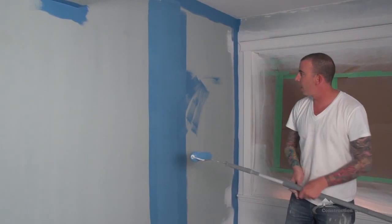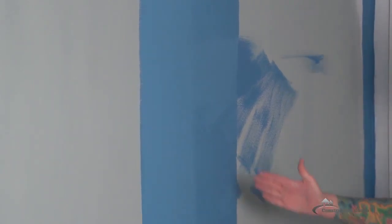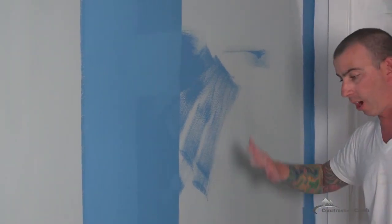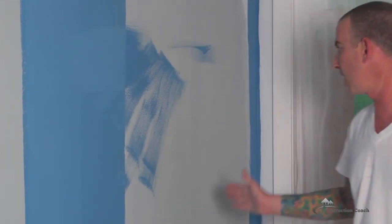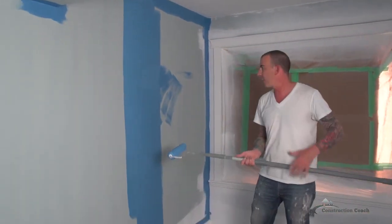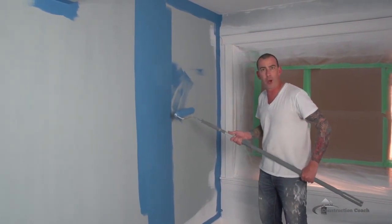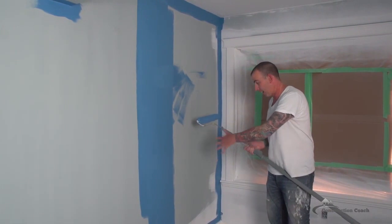My objective when I'm painting is to get as much paint on the wall as possible. From here to here, I'll try to get as much coverage on the wall and then back roll — go over the whole thing to smooth it all out. Then I'll take about another four-foot section, get it all coated up, and back roll it. It's a more effective and faster way than working on one little area at a time.